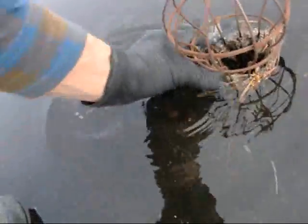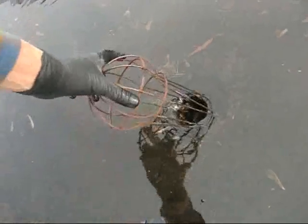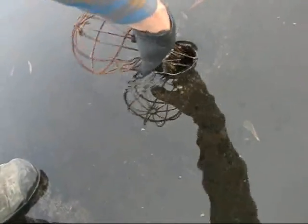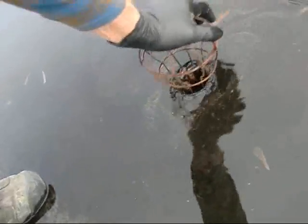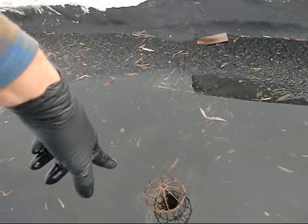Look at this roof — it's amazing how a handful of propellers and pine needles can cause this much trouble. They've got a three-inch drain up here, but it should be a four-inch or a six-inch. When you put the tar paper down you lose a half inch, so your three-inch effectively becomes a two-inch drain.